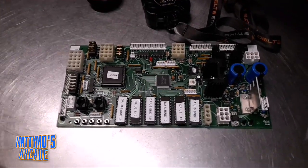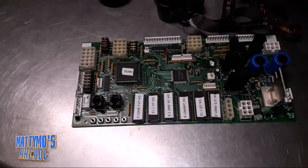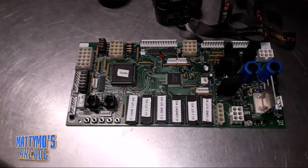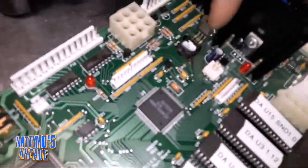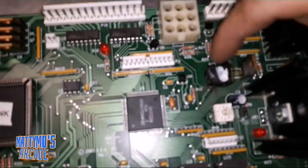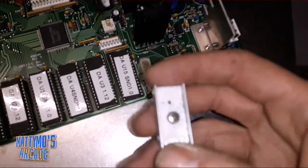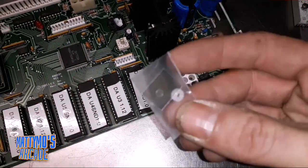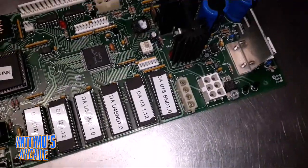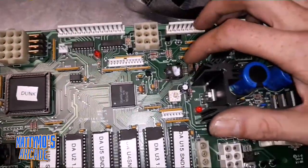I'm working on a Dunkin' Alien board. I don't know if I'll have a chance to get out and show you the game, but the target arm has quit moving, and it is this transistor here. You can see where it burns up the board, so I lifted it up. I have a heat sink, a little plastic piece, and a little thing for the screw to go in, and I'm going to hopefully keep that from going. I've had to do this before.